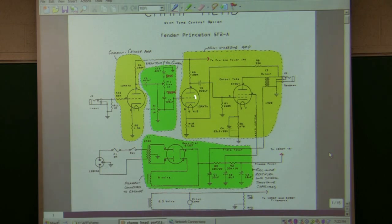And then this is kind of a vacuum tube op amp. It has a gain around 9.5 or so, and most of it's coming from this common cathode amplifier. This is used to give us a boosting in current. And there's a feedback around here, and it roughly goes as 1 plus the resistor ratio. If the gain of the op amp were huge, like an IC op amp, it would be on the order of a couple 100,000. Here we're talking about an open loop gain of around 20 or 30 or so.